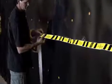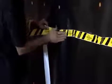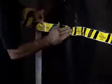Number 2, allow enough play or slack in the Acoustiblok material to give a ripple or a bend between the stud bays, between the ceiling trusses, or the floor joists. This will allow it to hang freely so it can vibrate, dissipate energy, and raise the attenuation of your construction assemblies. Number 3, all the penetrations for electrical, audiovisual, plumbing, any utilities or infrastructure of the home must be sealed with Acousticaulk and Acoustigrip tape.